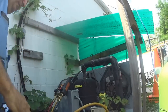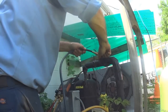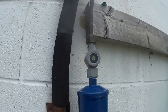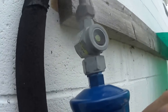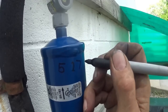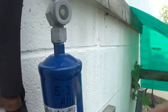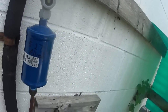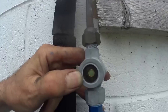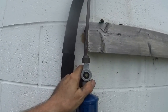Okay, I've got the oil and now we want to get some gas. I'll note the date — 5/27/15 — that way every so many years you know when to change it. I don't know if you can see the sight glass in there, but there are a lot of bubbles. I'm going to fill it up until we have no bubbles. Now if air got in the system with moisture, this dot would have turned yellow, but it's still pale green. Darker green would be better, but it's okay.